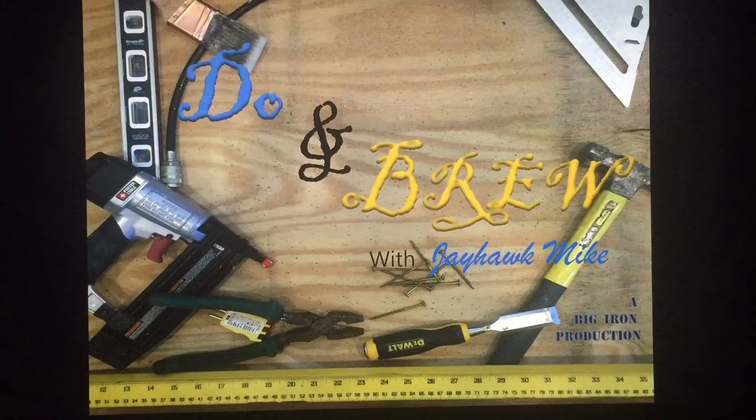Howdy folks, welcome back to Doing Room. Today we're going to be installing a new exterior door. This is the side door to our house, and this is on the list of projects I've never tried to tackle before. But it's not that hard to do. It's as simple as removing the old door, cleaning things up a little bit, sliding the new door into place, making sure it's square and plumb and true, and then securing it. We'll also be installing a new doorknob with a matching deadbolt lock, which has a combination pad on the outside so you don't have to remember your key all the time. And we'll follow this video up with a new video of how to do a Craftsman-style surround, similar to other surrounds I've done around the house as part of our kitchen remodel project.